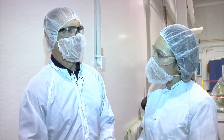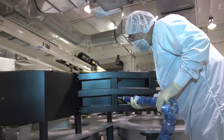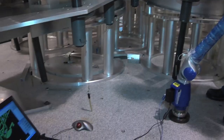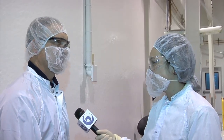So, Bob, I understand the real backplane is here at ATK now? Oh, absolutely. We can show you that, and we'll have to go in the clean room next. I want to show you some electronic measuring equipment to make sure that everything meets its final dimensional performance before we deliver. Is it like a GPS where it detects where that ball is located at any given time? Yeah, that's exactly right. That ball coordinates back on its surface to where the model is for the corresponding feature. This is very interesting stuff, but the suspense is killing me. Can we go see the backplane now? Absolutely. Let's step around this side and we'll show you the rest of it.